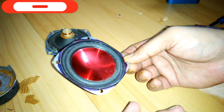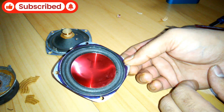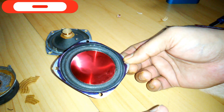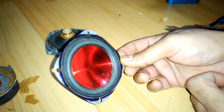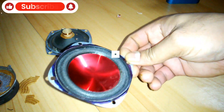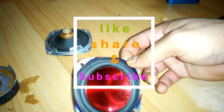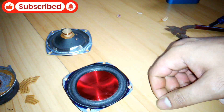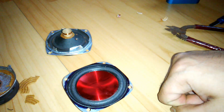You can make a bigger one like 8-inch or 10-inch if you have a cheap 8-inch or 10-inch driver at home that you don't use or it's damaged. You can use that and make a passive radiator, and then make a nice subwoofer with a passive radiator that's going to give you better sound. That's it guys, hope you like the video — if you have any questions, comment below, thanks for watching, bye-bye.